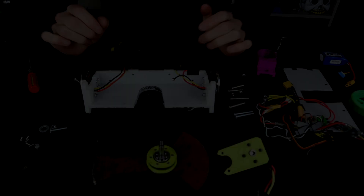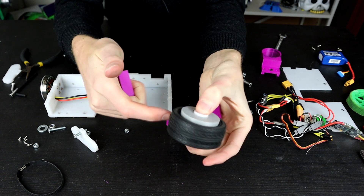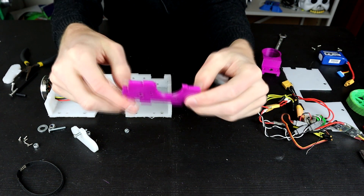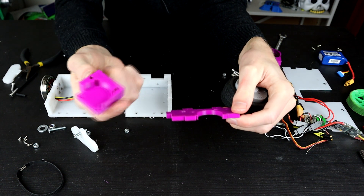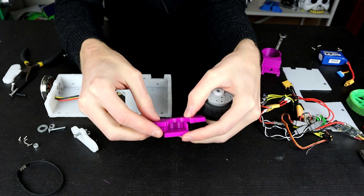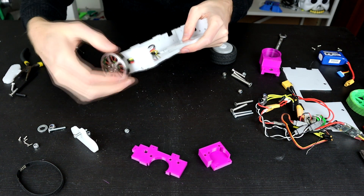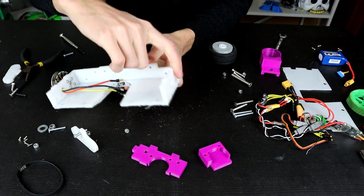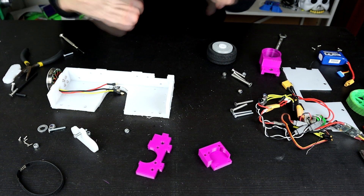Here are the new parts. We've got a new wheel using the same style I used in the tangential drive testing, and then I have a new piece which is a 3D printed version of one of these sidewalls - eventually this will get done properly in HDPE. Then I've got a spacer which actually mounts the motor, so these two parts go together like this and the motor sits in the recess, hopefully at exactly the right spot. I've left one motor on because I'm going to throw the wheel back on and make sure the height is aligned properly.